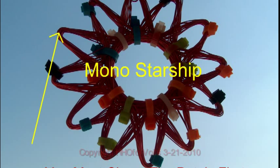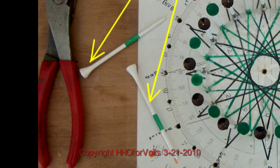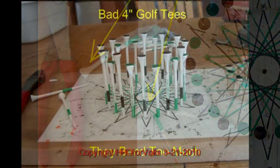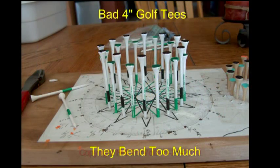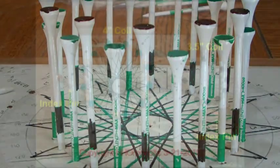Next is to add the center restraints — I would use eight. This is an update of my jig. Unfortunately, I bought the wrong type of T's. I want to wind coils with more turns, and I bought these long T's from a local store — they're plastic. What happens is they bend, so as you get toward the top or end of the coil, the center diameter changes, getting smaller. That's not desirable. Also, don't stagger the height — I thought that'd be a great idea with pins closer in a three-inch coil, but you want them all the same.